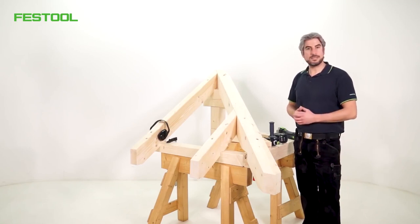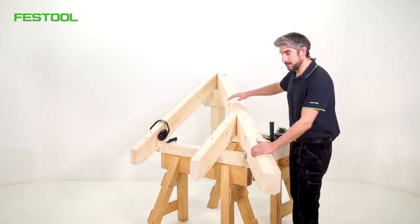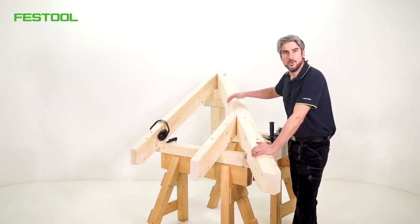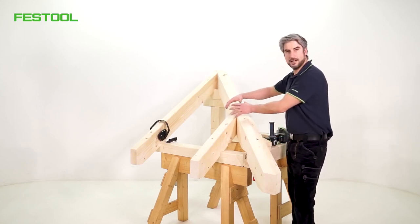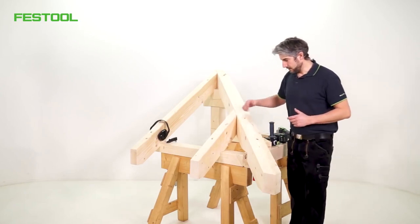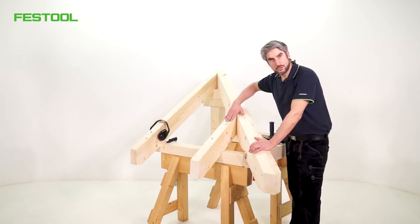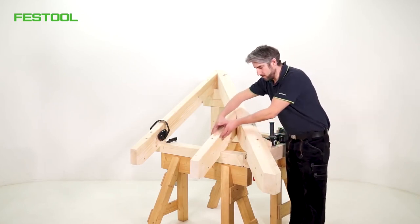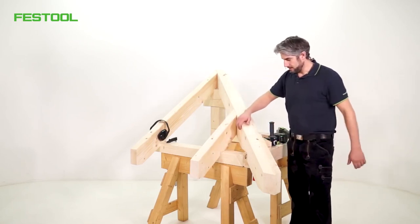We're often in this situation on the roof. If these roofs have not been well maintained, there are frequently leaky spots. Imagine that there was a faulty roof tile here. Over years or decades, water has trickled down and found its way into this area, which results in damage to the area around the base point of the rafter.